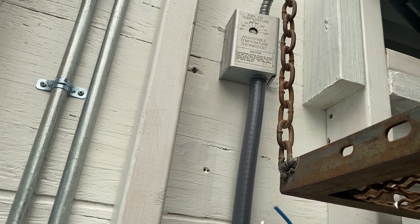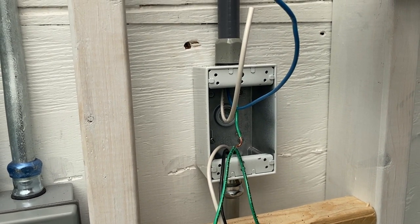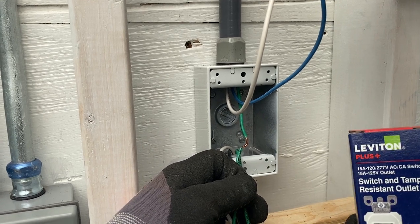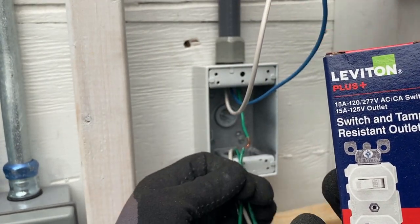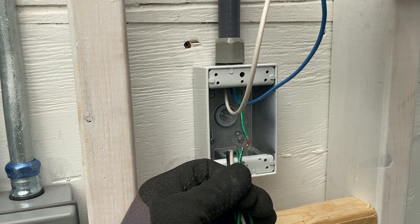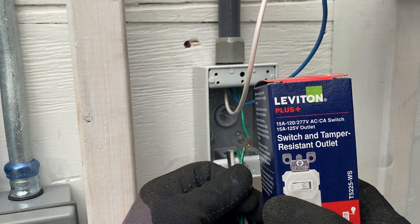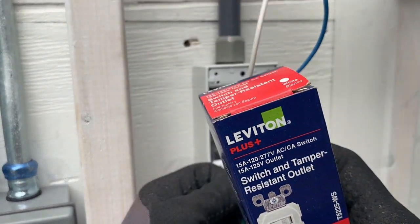The thermostat is finished. Now I'm coming down to the J-Box — it's a bell box. I've got my wiring coming down and the power feed coming into the J-Box. I'm going to be installing a Leviton switch-slash-plug combo. This circuit is GFCI protected, so I don't need a GFI here because it's on the load side of the GFI. The upper switch is going to operate the fan, so if I want to shut it off, I flip the switch and override the thermostat.